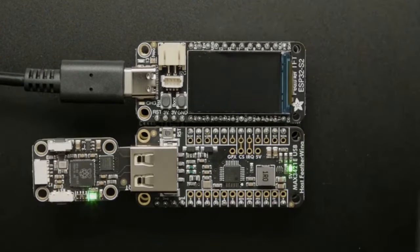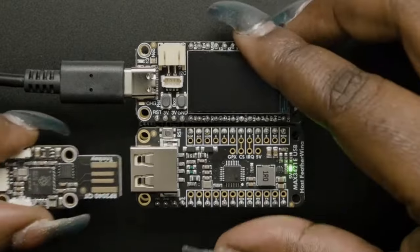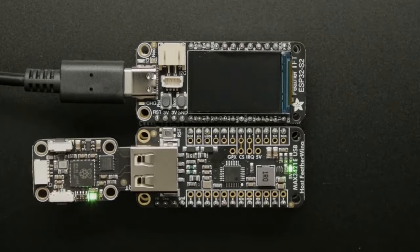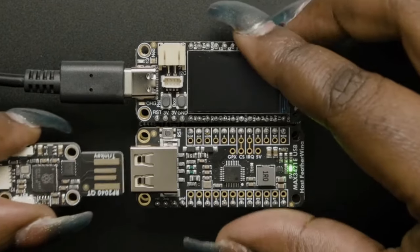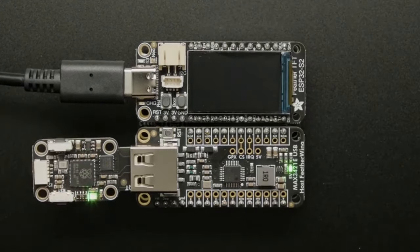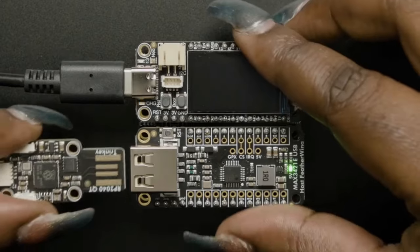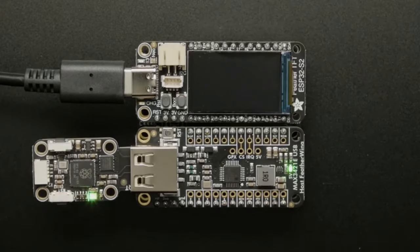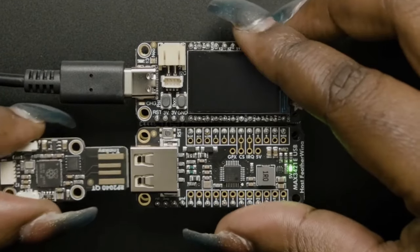So this, again, is tried and true, and has been around for a decade or more. Over SPI, it provides a USB host interface. What's really neat is that TinyUSB's developer, who works with Adafruit, has added support to TinyUSB for the MAX3421E as a native back end. So for chips that have TinyUSB support, like the ESP32S2 and S3, RP2040, SAMD chipsets, nRF52s, if they can use the TinyUSB Arduino library, you can now have USB host work with it, and it works really great. So you've got keyboard and mouse and mass storage and CDC serial input.